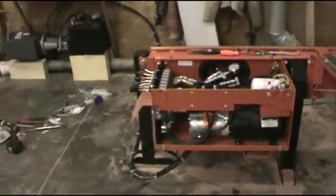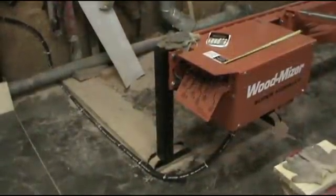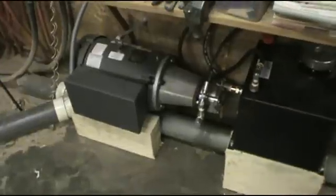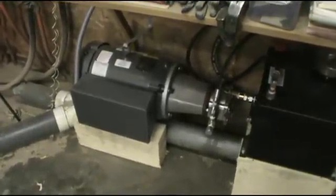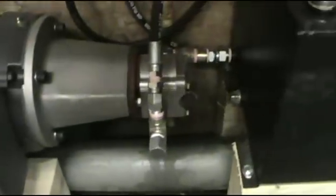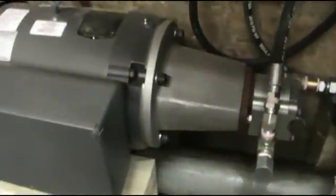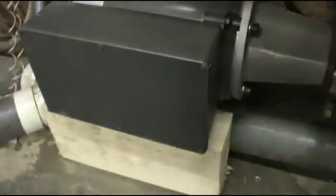Got the hoses all tidied up and the power cable attached, but we've come up with a problem — the electric motor is rocking when we go to start it up. So I put some tie backs on it to see if we can control the torquing of the motor at start up. The real problem is our hard connection from the tank to the electric motor to the pump. When the electric motor torques it's twisting on our steel connection — I went with steel, a solid connection, just to avoid pushing the pump assembly back into the Y of our dust collection. So now we have to put a rubber line right there to isolate the electric motor and pump assembly from the bulk tank, which means a little bit more fabrication and some time.